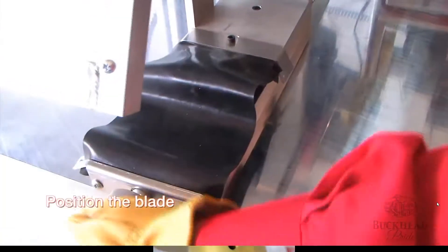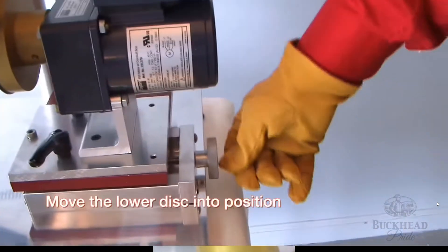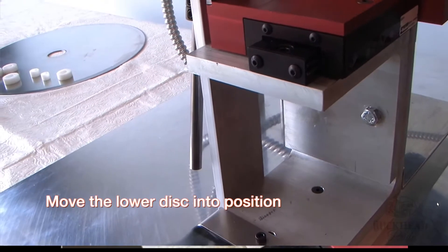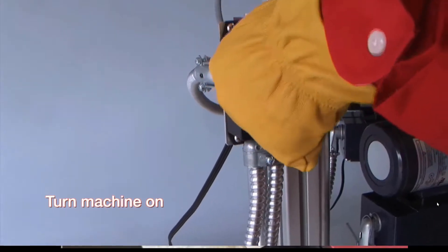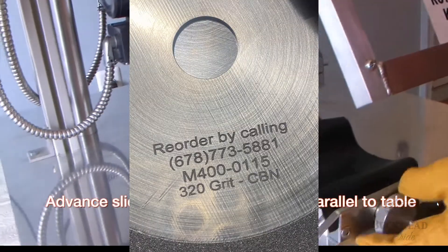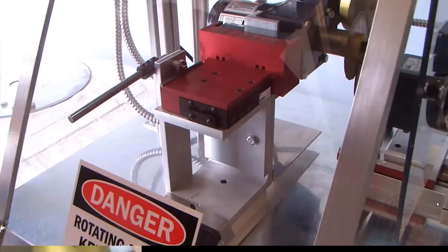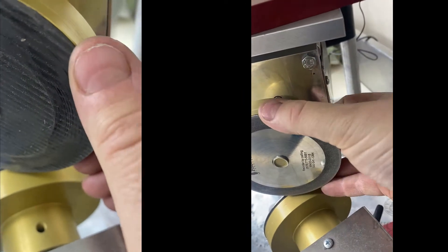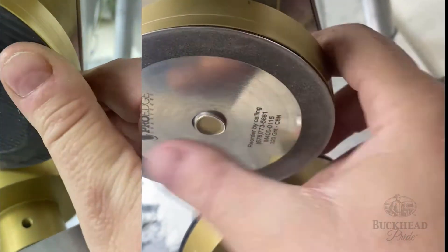I've created a couple videos which illustrate the problem directly. This machine had a problem with a balance set screw — it was 90 degrees in the wrong direction, so it wasn't providing the proper indication of the pressure applied to the grinding wheels. The grinding wheels, because of improper pressure, were slipping on the arbor, literally grinding a groove in the arbor and then slipping on the magnet that the grinding plates attach to.